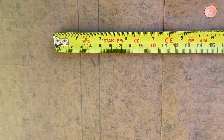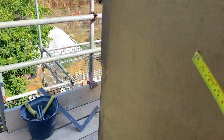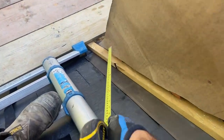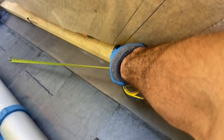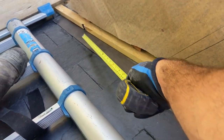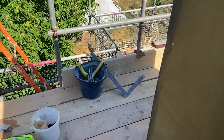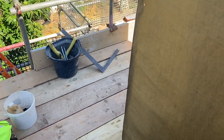It's like an inch back from that point there for your fold for your welt. Come back again 600, measure back 25 and 50, and mark where that one is. We'll do interlocking welts. What I'm going to do is measure from the top down to that batten there at that corner and coming down that line. That will give me my angle, then I just need to allow an extra 25mm to turn around for the welt, and that will give me my cheek. Once I've done this side, I'll use it as a template for the other side.